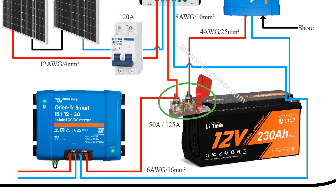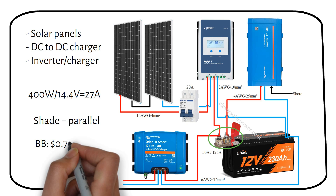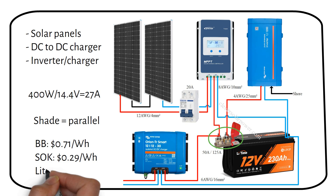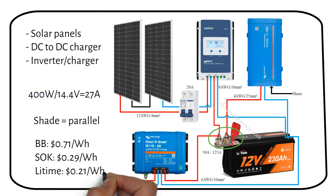We will use a 12V 230 amp-hour lithium battery. Why 12 volts? Because some appliances are still compatible with 12 volts — lights, USB outlets, fans and other things. The power of the inverter is still small, so you won't have to use expensive wires. Most van electrical systems use the Battle Born Game Changer batteries, which come in at 71 cents per watt-hour, while the 12V 280 amp-hour SOK comes in at 29 cents per watt-hour. I recommend getting the SOK or a similarly priced battery.